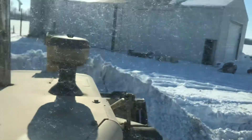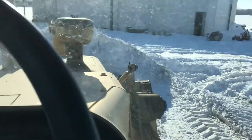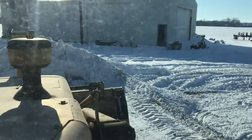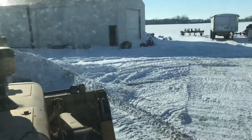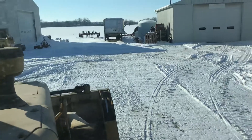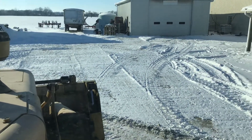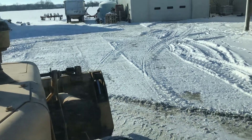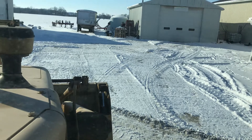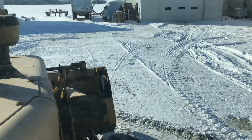It never used to do that — it would never slip the tires, it would just drag. We rebuilt the clutches and everything while we were doing it, so it's basically a brand new reverser now. But that valve — it wouldn't move at all. That whole valve was scored. Replacing it was a good idea. It was $400 some dollars, but at least I got a backhoe that works now.